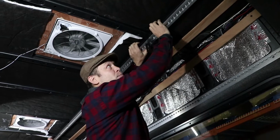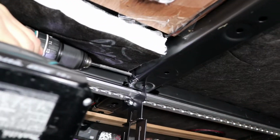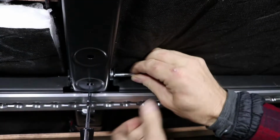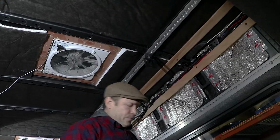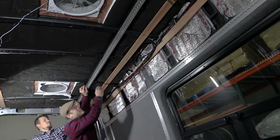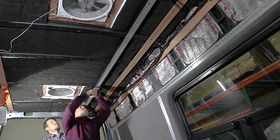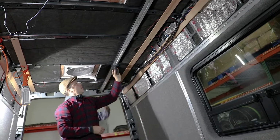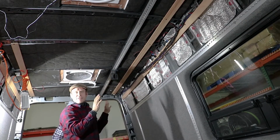Now this is held in place. You can actually take your drill and punch a hole on either side and either rivet it with a 1/4-inch rivet or put a 1/4-inch through bolt all the way through. So I'm going to set the front, and then we will set this into the back as well. And now the rail can be held up by itself.